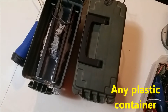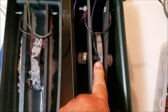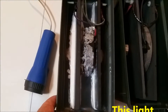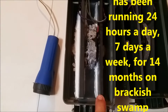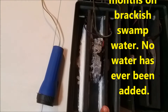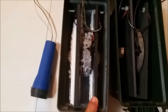You can use a plastic bucket or anything — it doesn't have to be this exact configuration. Here you can see I have a piece of magnesium and a piece of carbon, and how I've attached my wires. This is a liquid light that has been running for one year continually off one and a half liters of water. You can see how it has started to build up, and the magnesium is starting to rust away a little bit. That's called a sacrificial anode.